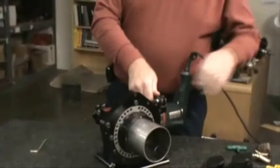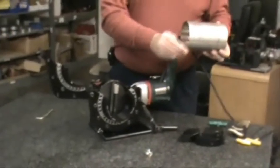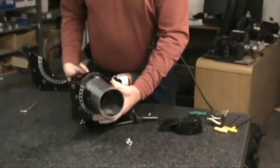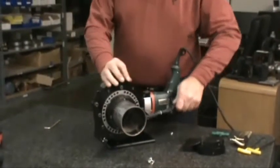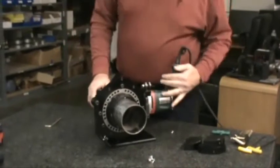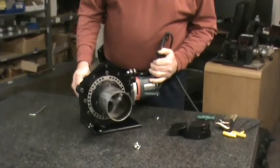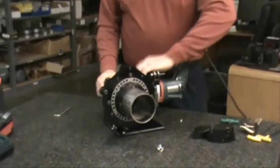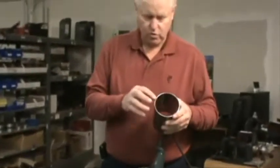When you're finished, you back it off. Loosen your head. Take your chip out. And you've now squared your piece of tubing. You go to your next side — it's quick and easy. Drop it in, back off your head just a little bit, cut your head, clamp it down, put it in, lock it, and feed your next piece. As you can see, the speed of doing this is very quick and easy. You've now cut square to your second piece of pipe and you're ready to move on to your next one.